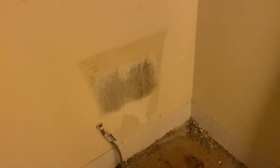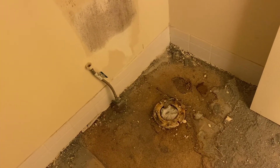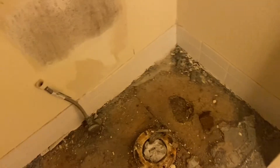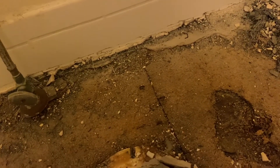The toilet is in this area also — it's actually been removed. You can see the flange here. We're probably going to end up moving that up when we put the new plywood in so we get a good tight seal under the toilet. I noticed a lot of damage in this area, particularly where the particle board starts to fall apart. Chances are this toilet was actually leaking somewhere around the flange, and over a period of time the water started to damage all the floor underneath the tile.